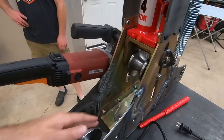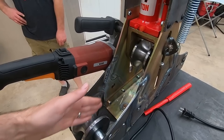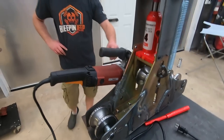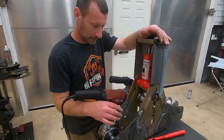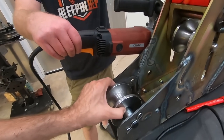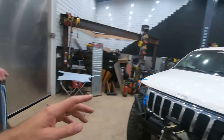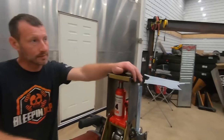So from what I understand, from here to here is not gonna get bent at all. So if you want to continue the bend all the way to the end of where it's gonna get welded, then you need at least like 8 inches extra tube on either side. If you wanted to cut down on that, we could move these in, but every time you do that, you run more of a chance of deforming it, I think, and it gets more difficult. And the bearings are taking a lot more force. Yes, the further you move those in. But I don't think we need bends all the way to the end, because we could just roll from here to here and then have kind of semi-straight sections on the end.